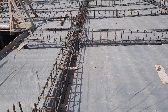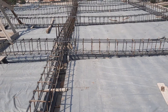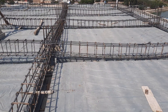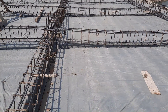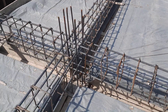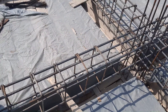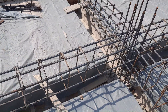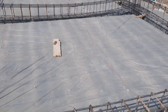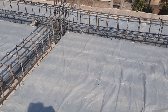The distance between two columns on one side is 18 feet and on the other side 16 by 20 feet — short beams are 16 feet, long beams are 20 feet. The design is not proper for this five-story commercial building. The cantilever beam design is clearly wrong. I have already discussed the proper way in many videos on my YouTube channel — please check those practical videos about cantilever beams. There is also no development length visible.